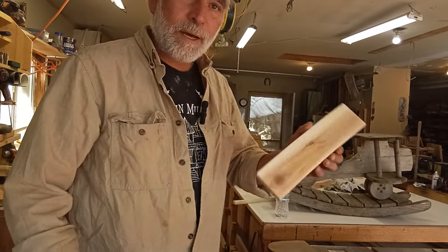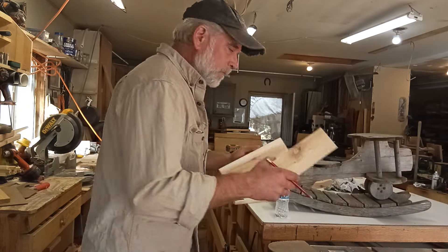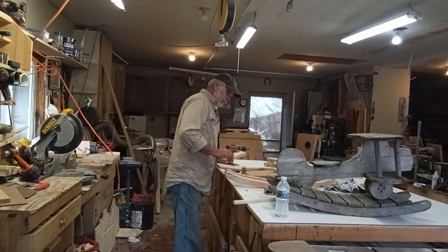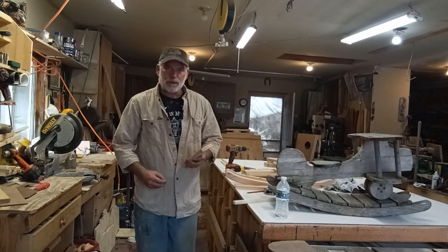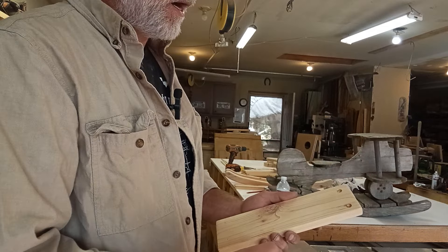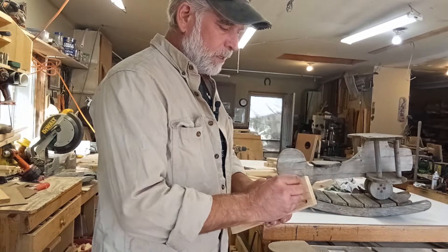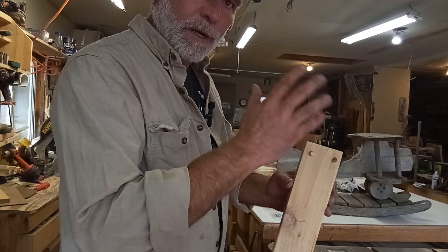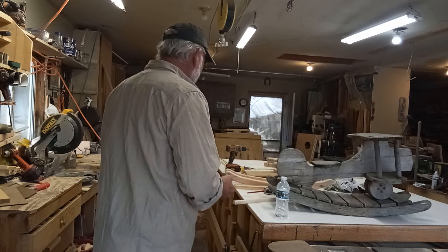I went through and hit them all because my dad and I weren't sure who was going to do it, so I wanted them all uniform all the way through. You can buy little jigs to cut these little pegs out. Actually my CNC does an excellent job — you just put a piece of scrap in and cut them all out. They just go in to cover the screw holes, you glue it, cut it off, and you're ready to go.